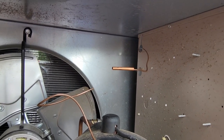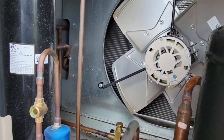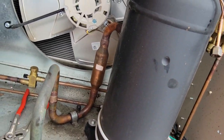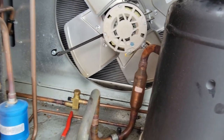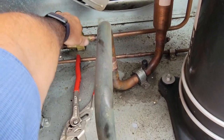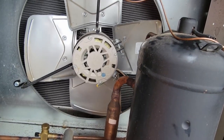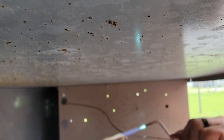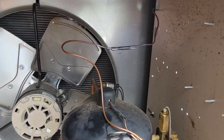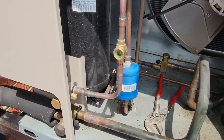No sense replacing the switch — it's only probably a year or two old. It looks like maybe it's two years old. The system shut down on the low pressure switch cutout, so it wasn't pulled into a negative. The switch isn't bad. Probably going to skip running the dryer — we are super busy. Got to pull a vacuum on it and move on down the road. Check all of our caps, make sure they're not loose — they have a tendency to be left loose from the factory. It's the low pressure switch; it cut off when it got down to pressure. I thought that was a fan cycle. They have a headmaster back here in the back. If it was a five-year-plus old switch I probably would have changed it — not that big of a deal.